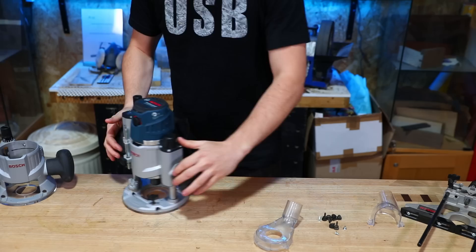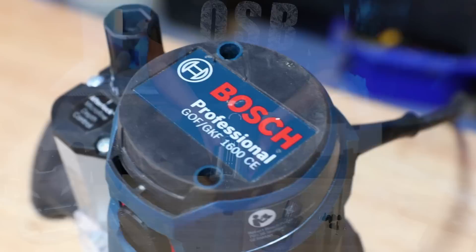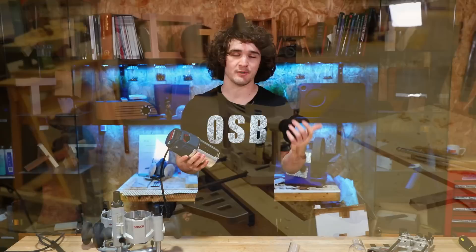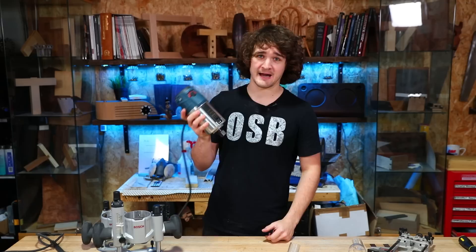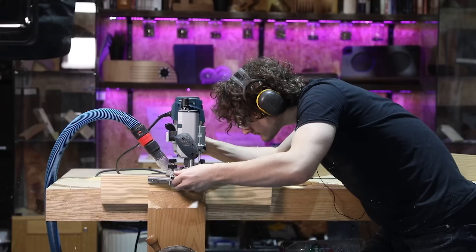Let's have a look at the motor unit. The '1600' in the GMF 1600 refers to the wattage — 1600 watts. In the US version that's about 2.3 horsepower. That's middle ground for a router of this size: the Festool OF 1400 has 1400 watts, while Makita and DeWalt are closer to 1800 watts. I've never noticed any lack of power or slowing down — there's plenty of headroom. Circuitry inside provides constant power to account for fluctuations in material density or depth of cut, maintaining a fairly constant speed in use.